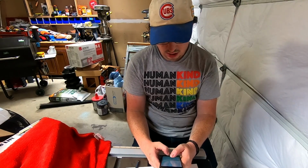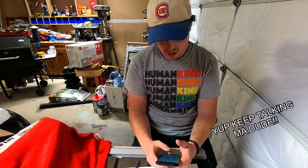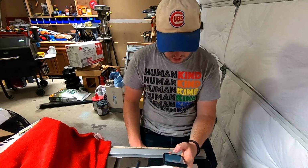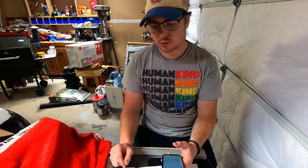Corrugated tin roof. Alright, corrugated roof. They come in 2.5 feet. We do a 6-inch overlay on these guys. You want to overlay it. You're going to overlap them so that you don't have water leaking in between your corrugation. So really, it's 2 feet.